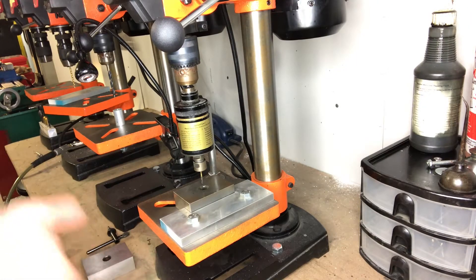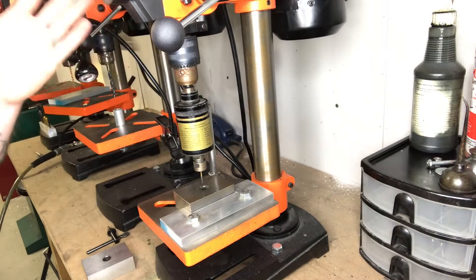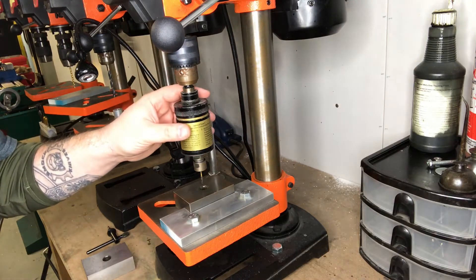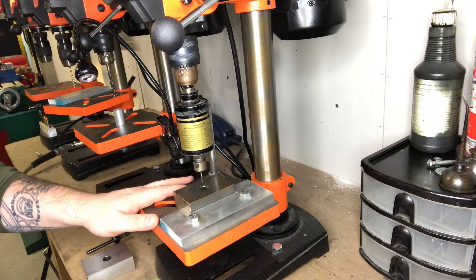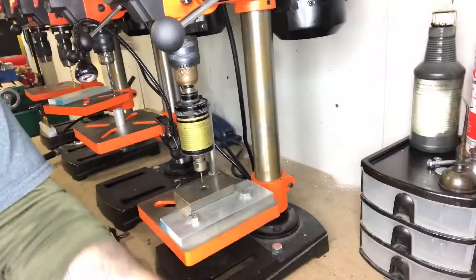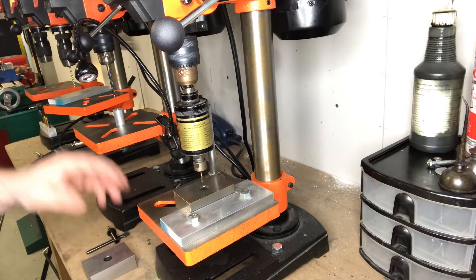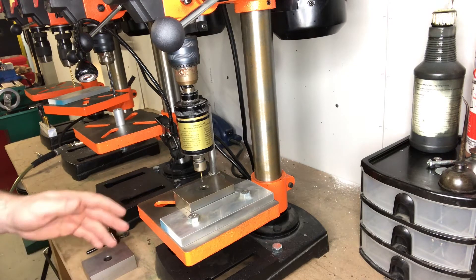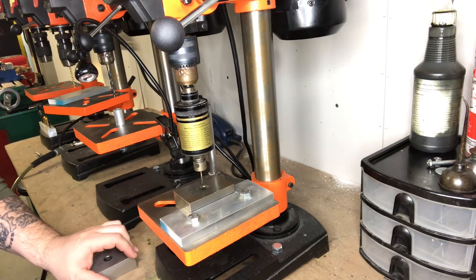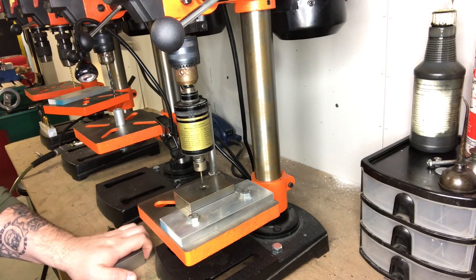That's it, guys. My camera is losing power but I just wanted to show you a really easy setup. The drill press is about 60 bucks, parts from McMaster-Carr around 25 bucks, and the Tapmatic cost me $200 — completely worth it if you're tapping a lot of handles. I probably spent that much in the first six months breaking thread-forming taps at $10-12 a piece, going through 20 or 30 of them. Hopefully this helps — like, subscribe, I greatly appreciate your support, and hope to keep making videos to help you out. Thanks!